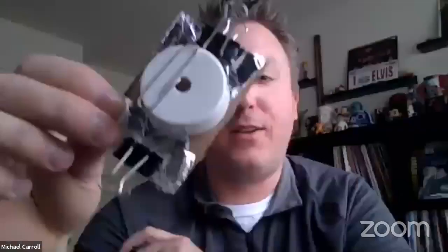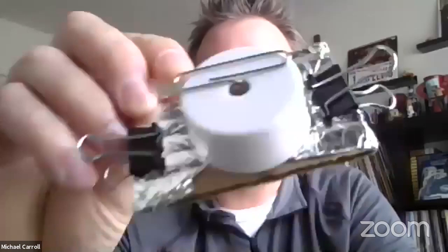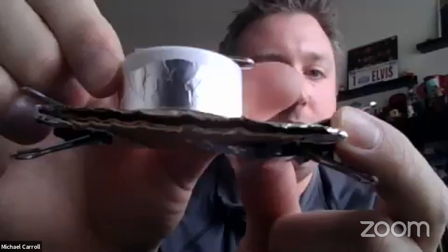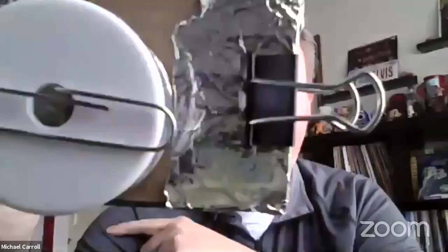All right. So the other one is probably the hardest. My friend that makes them with first graders, they skip this switch. This switch is using the shell of the LED tea light. And what you do is you put some tinfoil on about half of it. So you can see about half of it is covered and half of it is not. And that's applied with just some glue stick, just cover it in glue and fold the tinfoil over. And then on the brick itself, one side has tinfoil and the other side is tinfoil. I kind of nickname this one the salt and pepper shaker sometimes, because you spin the lid to bridge the connection.